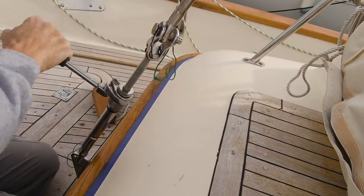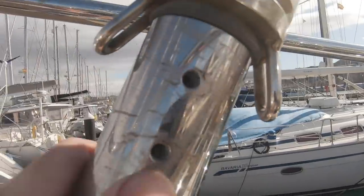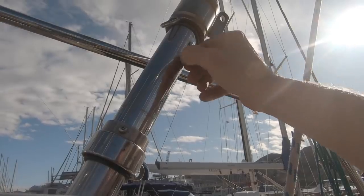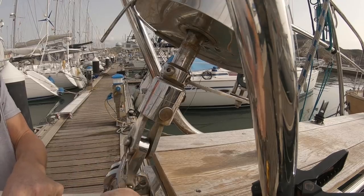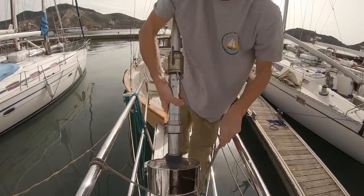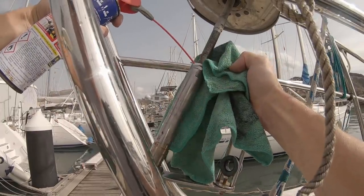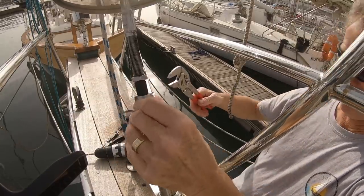Just as belt and braces, I put in a removable stay that we have our storm sail on, tightened with a highfield lever. This is the bit that needs welding, so to get it off I need to slide the drum up to get to the bottle screw. True to form, you've got stainless steel going into aluminium and two of the bolts have broken off, so a bit of drilling is needed — I'll drill them out a bit bigger and tap the holes when I put it all back on.